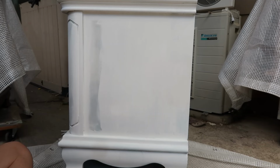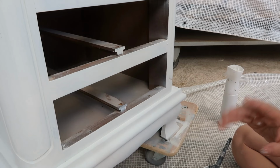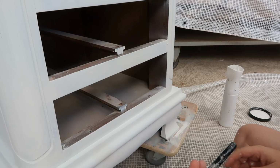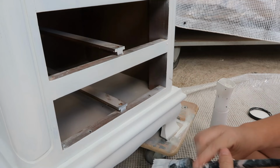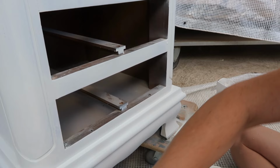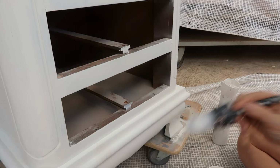Okay, I'll be back. Right, I'm just going on with the next coat, which is going to be the final coat. Fantastic. And because it's a really hot day, I just wanted to show you how I work with these mineral paints. I've only ever had this issue with Dixie Belle and Fusion, because they have a relatively short work time. So I do spray, and that's not reactivating it. It won't activate the paint that's underneath. All that it does is give you a little bit more work time. So not much. Just a little mist, and generally only on the final coat, but it'll reduce brush strokes and give you that better work time. So I do that, not always, but just on these hot days.